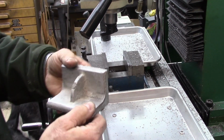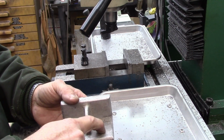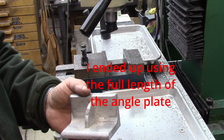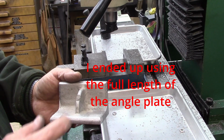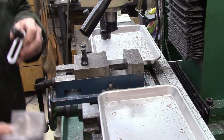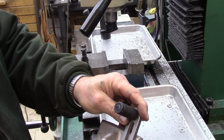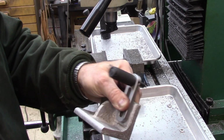What's going to happen with this is it's going to be set on one T-slot on the table. I'll bolt it down into the T-slot with a T-nut on the bottom and one bolt down through here. Then we're going to mount our index pointer on the inside of this. I'll probably cut this part of it away because we don't need that, and this will stay with the rotary table. I'm going to cut out a little pocket around there to index on the pin. The way this will mount is this index mount is going to sit on here just like this. We're going to have a little bit of adjustment in here so that I can adjust it up and down, and this will index into our wheels on the front of the rotary table.